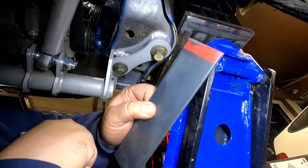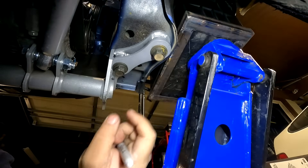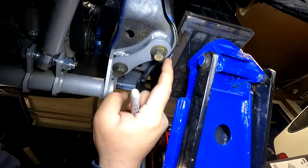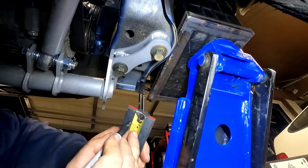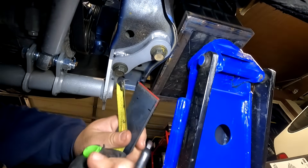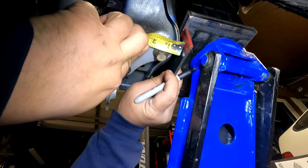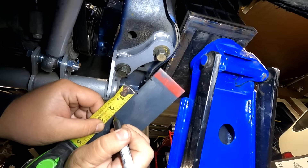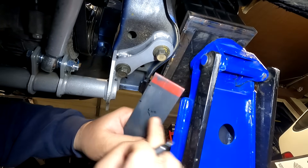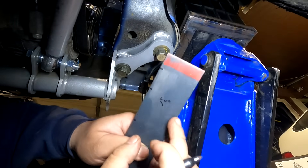This is all the flat stock I have left, so I'm going to make the bottom bracket and tomorrow I'll buy more material for the third one. I need a Z-style bracket here to weld onto the tray and bolt up to the 17-7/8 on both sides. It's about one and a quarter, so: slice here, bend it, slice here, bend it, cut to give us the two-inch — and that should be the Z I'm looking for.